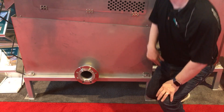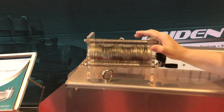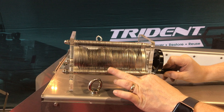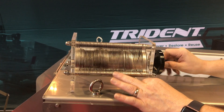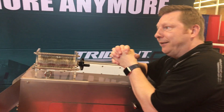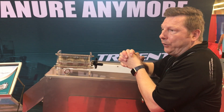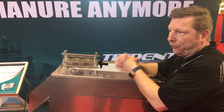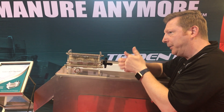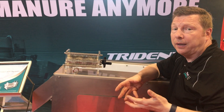This is obviously a tabletop display because we couldn't get it in our booth to have both machines. The ND press, as you can see, presses out all of the water and compresses the nutrients that are now bound together in the polymer to create what we call a cake — which will be 20 to 25 percent solids. All of the NPK — the nitrogen, the phosphorus, and the potassium — is attached into the cake.